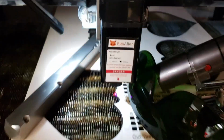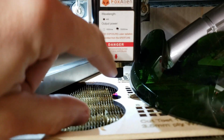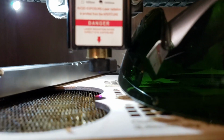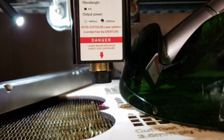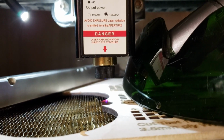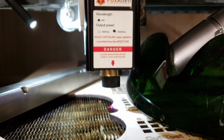So this is how I make sure, once I found that perfect spot, I set it to 30 millimeters. Right now, from the surface to the bottom of the heatsink, it's 30 millimeters. I made sure of that, and I locked it in with my lock ring here. This stock lens is now unscrewed beyond the point where that O-ring can engage, but the lock ring holds it in place and locked down. And we're going to now put on my nozzle, and we're going to see how the stock lens compares to the G8 lens.